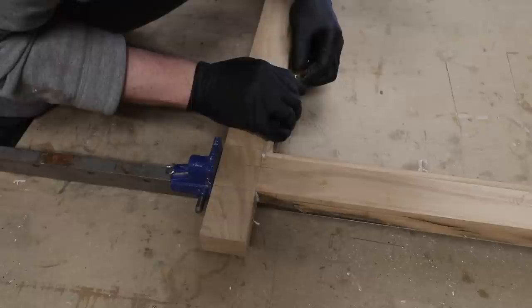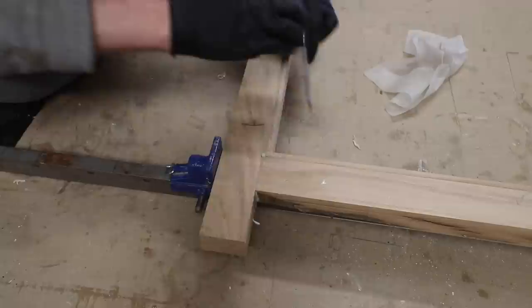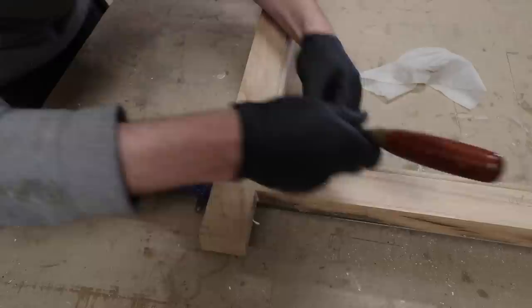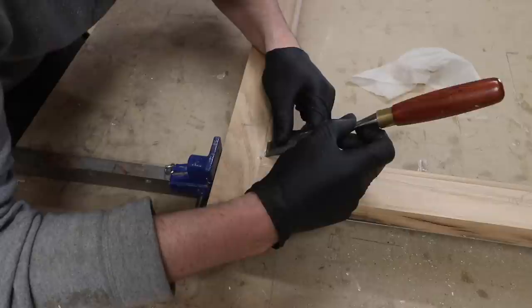Like I say, you just want to wipe just to keep your chisel clean. So every time you encounter a bit of wet glue, just clean your chisel. That'll stop it spreading. The more you spread that wet glue around, the more it's going to be a pain to try and remove and sand, because the plasticky texture of it doesn't really sand particularly well. As it squeezes out like that, it doesn't really stick to the surface either. So as long as you don't push it into the surface of the wood or the faces where you've not applied it intentionally, it doesn't particularly stick that well anyway.